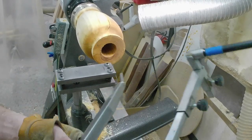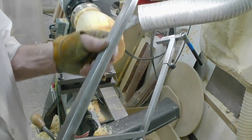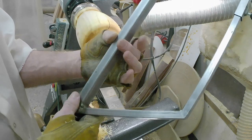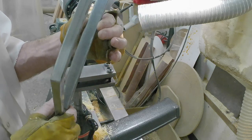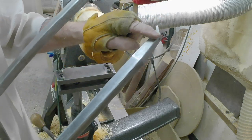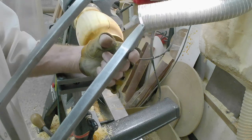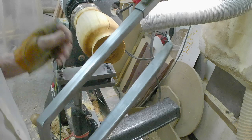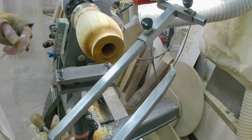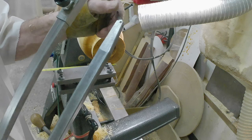Okay, now the hollowing tool itself. The bar is from a salvaged power takeoff shaft that's available in Tractor Supplies or Steel Supplies. It measures 7/8 deep by 7/8 wide by 3/4 inches thick, and I've milled it about 10 or 15 degrees out at the end here. I milled off to make the end more petite and would fit into a tighter bottom, and I've milled it this way about 15 degrees for a distance of approximately 2 3/4 to 3 inches in. This is drilled at 45 degrees for a 3/16 bit.